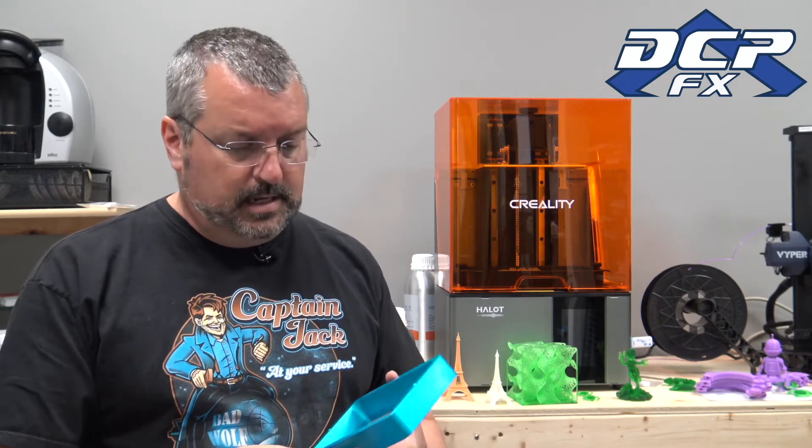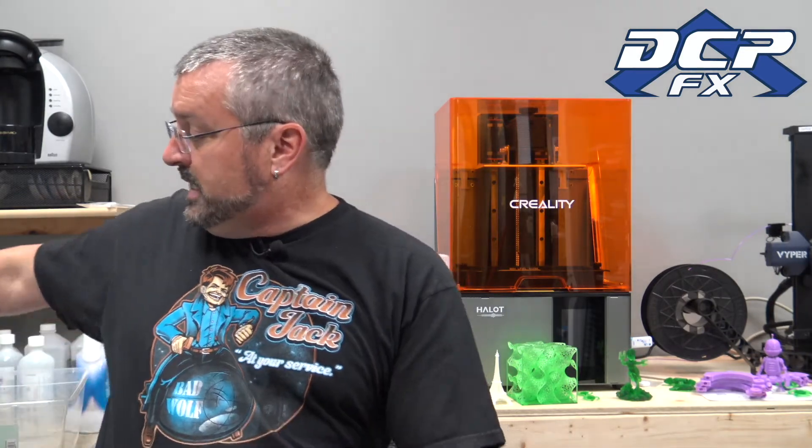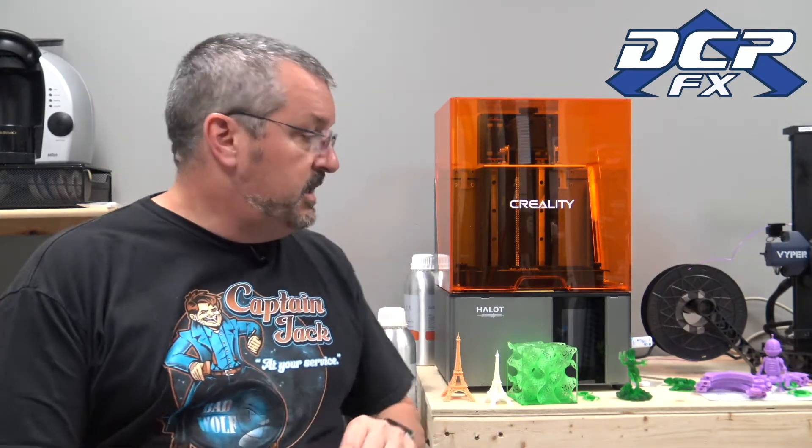Some people also say up to 325 Hz — it depends. But if you're in the low range, your FEP is way too loose, and all you need to do is tighten up the screws here and you're good to go. That is a really easy way to deal with your FEP. If you're having problems where your prints are sticking to the VAT and not going up on the plate like they're supposed to, you might want to take a look at that.